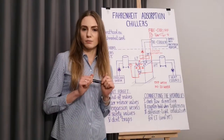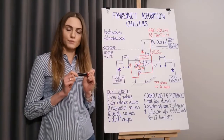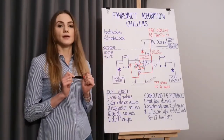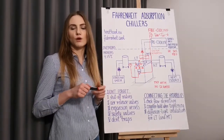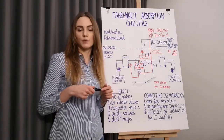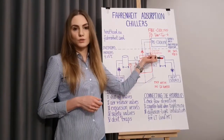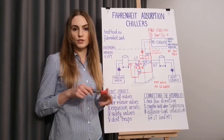When choosing the installation place, please remember that the recooler must be accessible for maintenance. If you plan to place it on the roof, make sure that it will be safe for maintenance technicians to go up there. And since recoolers can be really heavy, carefully check the carrying capacity of the roof as well. The recooler should be filled with a mixture of water and ethylene glycol. The concentration of glycol should be based on the lowest expectable temperature in the place of installation, so that sufficient freeze protection is granted at all times. For Germany, for example, we usually use 34%. Remember to rinse the glycol lines sufficiently and avoid possible bubble formation during filling.